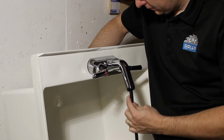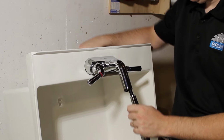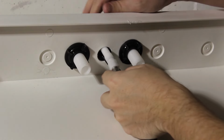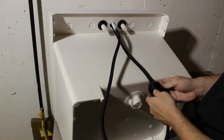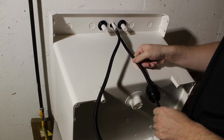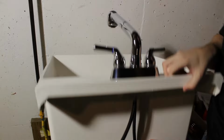And once we get this hose pushed through the stem of the spout, we're going to connect that center water connection for our mixed water supply to the sink. Again, remember this is hand tighten only. This is plastic on plastic. You don't want to break these with hand tools. And the last piece of the hose is a counterweight, and this helps you put the hose back in place. You want to put this right above the loop so it gives you enough slack.